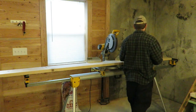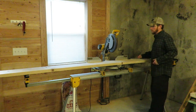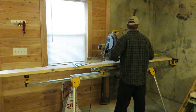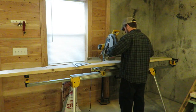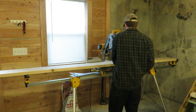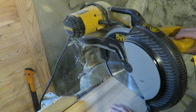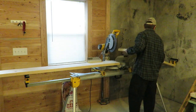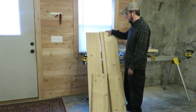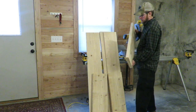So we're going to cut and square up the ends. Then we need two 54-inch long pieces and one 27-inch long piece from this board. In our next 2x10 we're going to need one 54-inch length and two 27-inch long lengths. When you're all said and done you're going to have three longs and three shorts. Depending on what size windows you're using is going to determine what length you need — I'm using three 54s and three 27s.